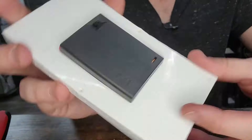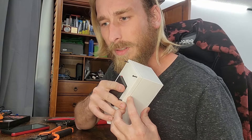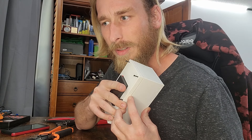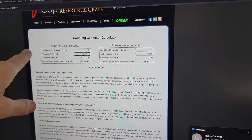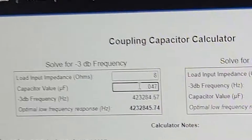The battery pack is just a press fit. I was about to record the next part and I turned this on and it has this really high-pitched awful noise. Let me see if you can hear that. Yeah, it's super slight but it's there and it bothers me. Let's see if we can figure out how to fix it. I think a low-pass filter is going to work — this is what I came up with. Did a quick little research: 8 ohms. I just tried this capacitor, and apparently the cutoff point is there and that's working perfectly.